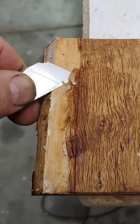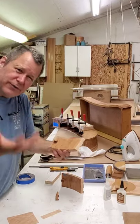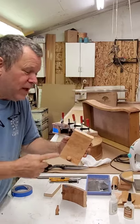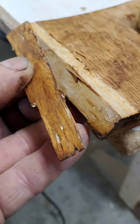So I had to cut that out, and putting a new piece in just wouldn't work. I can certainly match the color with dyes and stains, but the figure didn't match. So what I did in this case — I grafted from another area. I actually took the good piece off the edge and applied it to the front.